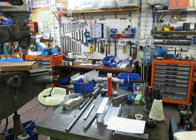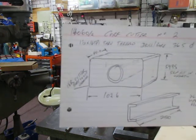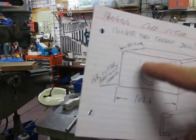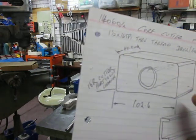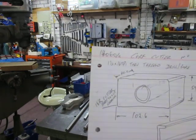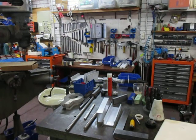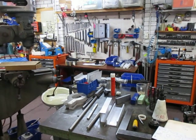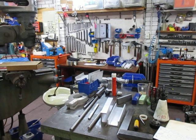Tonight we're starting to battle away on it, and the part we're talking about at the moment is this block. This block is what holds the cylinder in place and the two channels feed down through it. I've shaped up this block to the sizes and I've now mounted it in the milling machine and I've gone ahead and started drilling it, getting it ready for tapping. I'm doing the whole job here in the mill rather than at some point moving it over to the lathe.